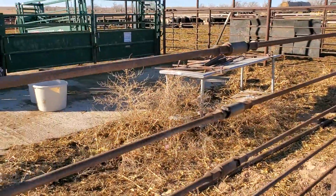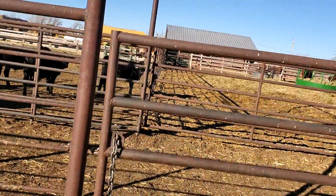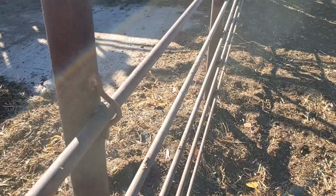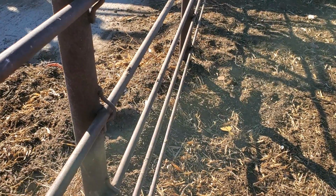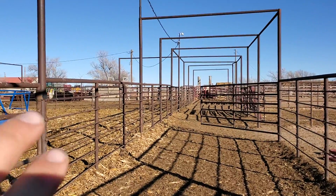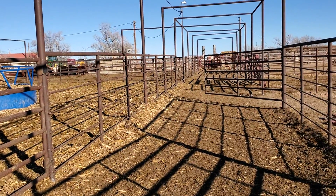The other thing I will say, if you're going to use the sucker rod, and if this is the cheapest route, go the cheapest route. Buy these clips. They sell them at pretty much any welder supply. Go ahead and weld all your sucker rod, and you can come back in and clip everything. That's what we did. You can see that weld is broke right there. But with that clip in there, it's not going to go anywhere. We did that on all of these fences, this main sorting alley, because we're always having stuff brush these fences and run into them. That's just the way to go.